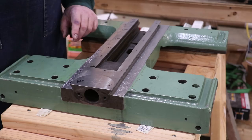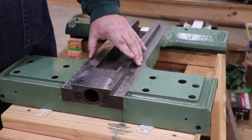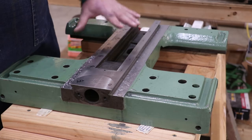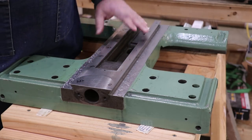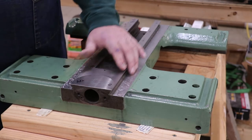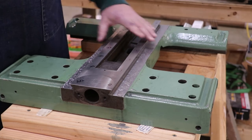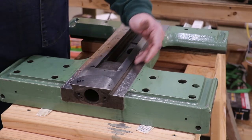If you didn't watch the last video, here's an update on where we're at: we've already come in and scraped these two flats, and when we measure them they're in pretty good shape. On this end, I kind of quit at a certain point because I wanted to see where we were - there were a few little low spots in here, probably insignificant, but I do want to go back over this side a couple more times just to get everything nice and flat. I didn't want to take too much metal off until I saw how we compared to the other side, and I think we're going to be fine, so I'm probably going to start by doing a couple passes and try to get those low spots out.